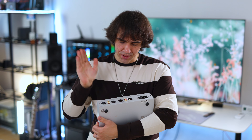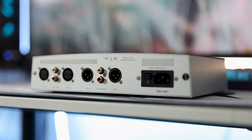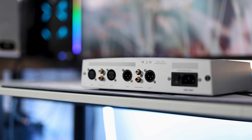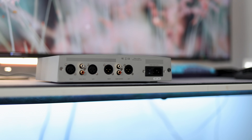The display stays on and shows the current volume, temperature, gain mode, and current mode — everything you need to know. Since this is not a DAC, there are only analog inputs: an RCA input and an XLR input. The RCA input is single-ended or unbalanced, while the XLR input is balanced with three pins per cable. We also have a pre-output at the back in either RCA or XLR format, a kettle plug input, and an on-off switch. The unit doesn't turn off by itself, so you need to engage the switch at the back or use the remote.